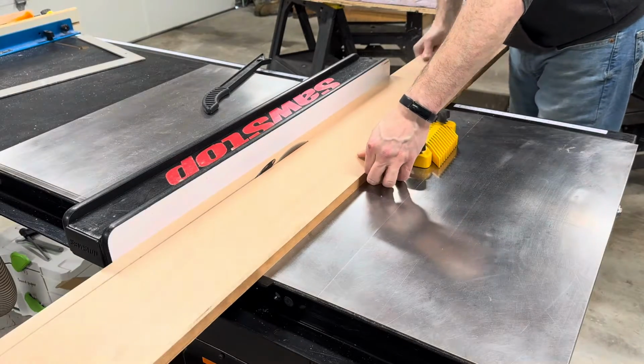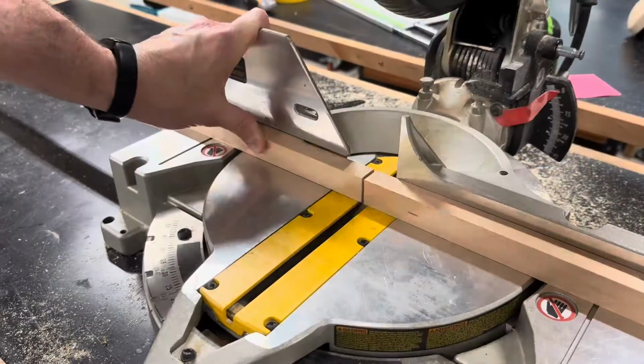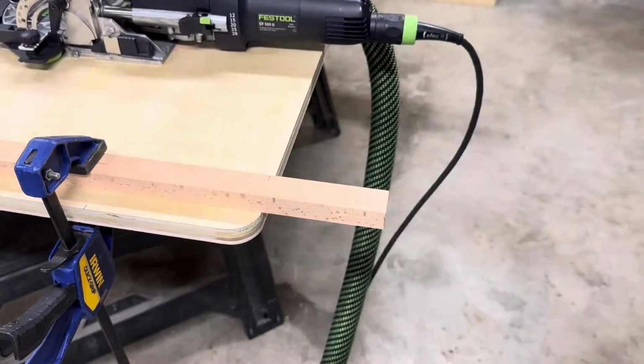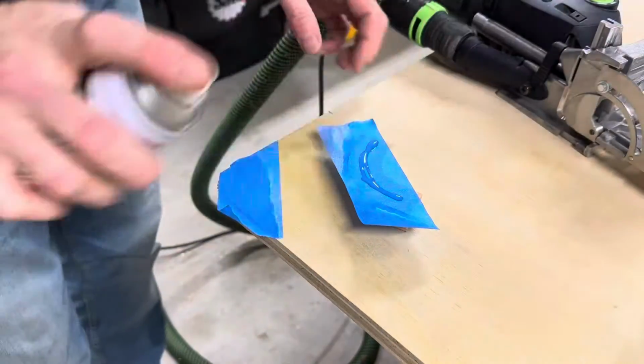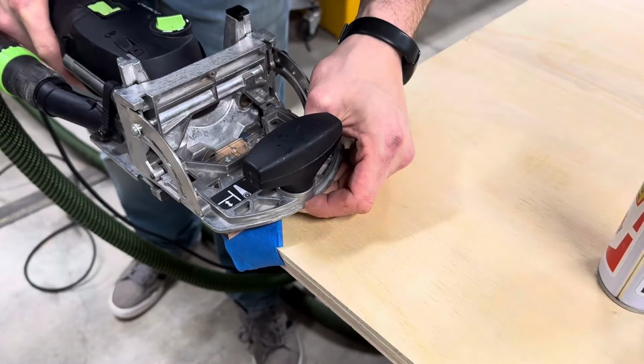With the pieces for the corners figured out, I went ahead and cut the long, straight pieces for the sides. I probably could have just edge glued these onto the plywood, but I decided to add some dominoes for extra strength. I also used the dominoes to increase the strength of the joint between the corner pieces and the long straights.